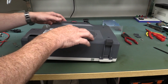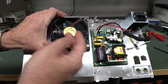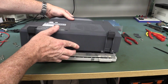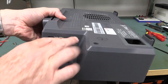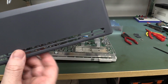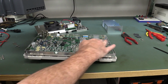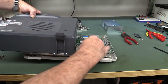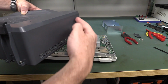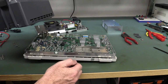And from a thermal performance point of view, we've got our vent on the back here. Our fan is blowing outwards like this. So this is the outlet fan, and the inlets are here, and ta-da, some along the edge here. It's good that they put them at the bottom like this, draws the air over this board, over the heat sinks, and then out like this. If you put them at the top, it's not quite as efficient as if you put them in at the bottom. The air comes through the bottom there.